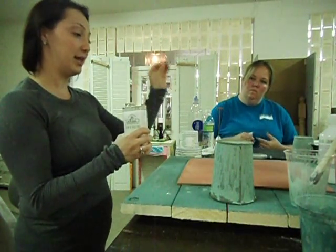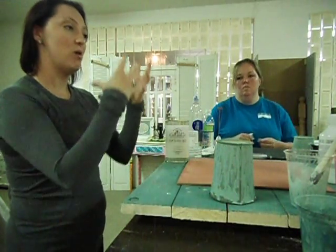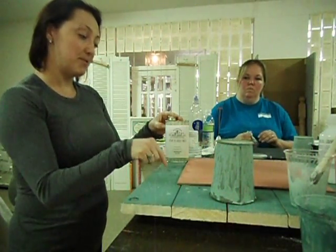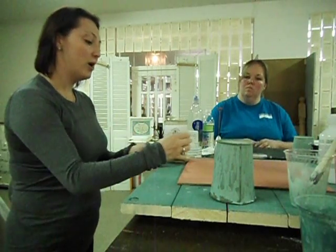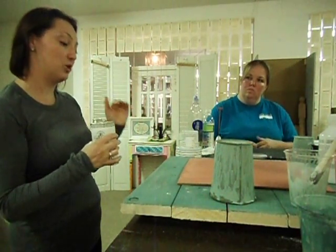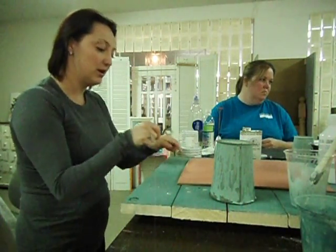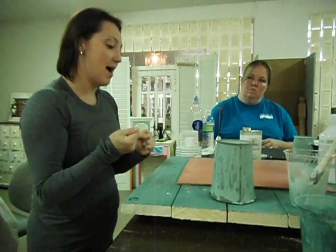So if you want to control your chippy and exactly where it's going to be, just put a tiny, thin amount — you just have to be able to see it, and that's all. You don't want globs of it; you certainly wouldn't want to see drips of it. You just want a little pass of it. I recommend that you do a bit of experimentation to see how much you need. On a porous piece like this, you're probably going to want two coats to really resist that. Two coats and it's going to come off for sure. Then once you're happy with the level of chipping, you can just flake it off at your fingertips, pass over it with a scraper, and it's going to lift it all off. Then you can put your poly coating on.